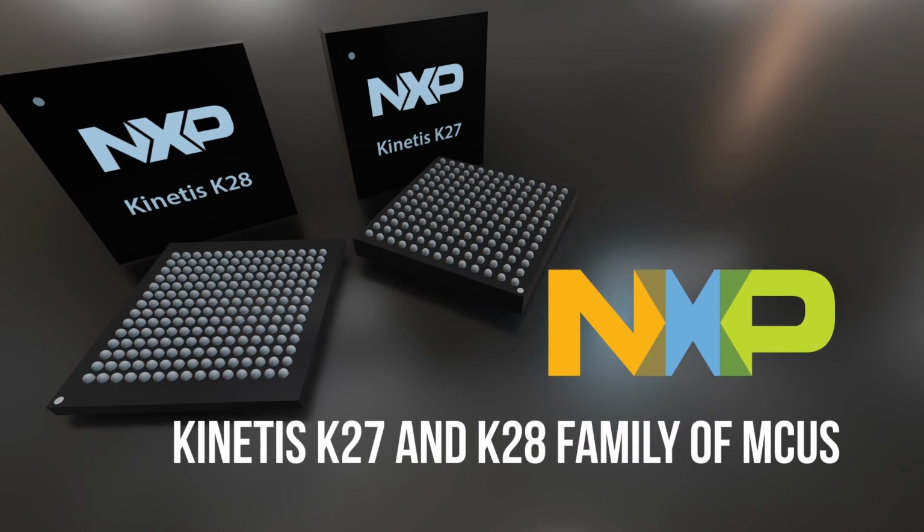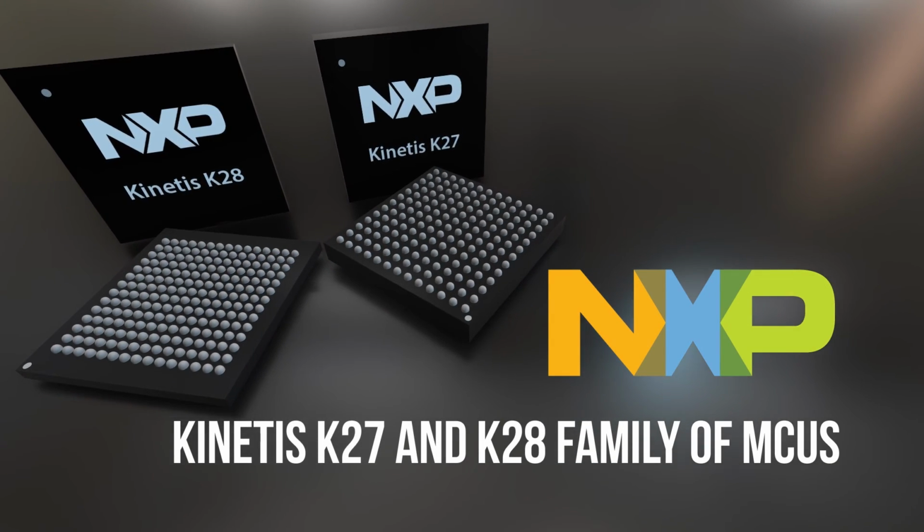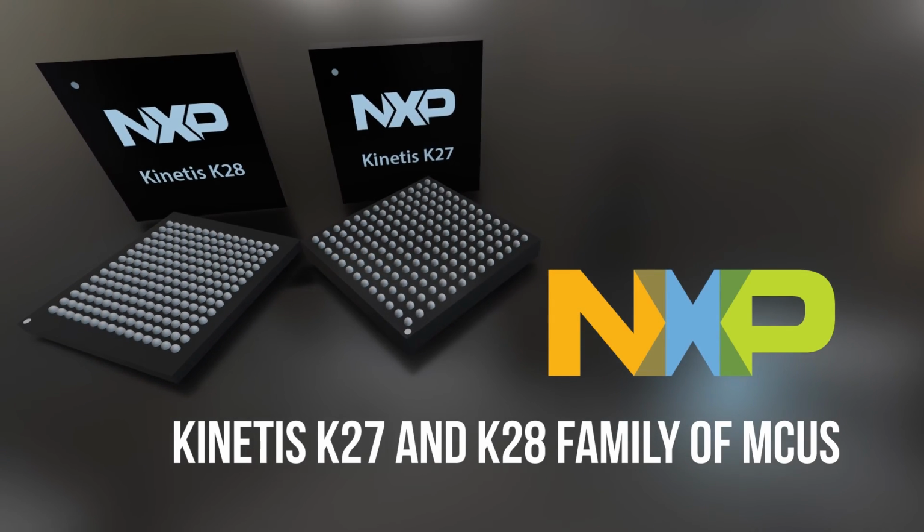Both the K27 and K28 are available in a 9x9mm 169-ball BGA, while the K28 is also offered in a 210-ball WLCSP. NXP also offers the Freedom K28 development board, with extension boards for capacitive touchscreen, USB Type-C, BLE, and more.